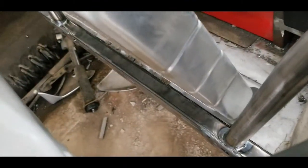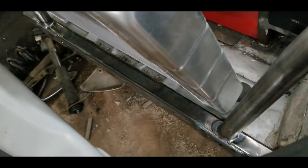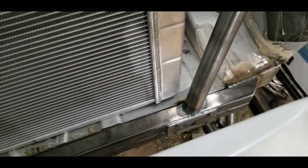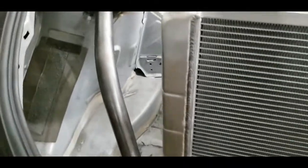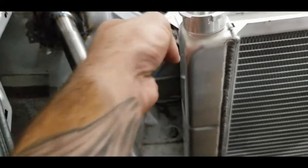And then we'll also have the fan mount come off the back here. I haven't decided if I'm going to do a separate mount for the fan. I did that on Austin's car, so the radiator core could just slide out and we could leave the fans in. I think this one might be all in one unit. But basically everything in the back here is just going to be mounting fire suppression, the expansion tanks, the swirl pot, the water pump, all that's going to mount off this main structure. Kept it swooping in so that we could keep some of that weight as close to the center as possible.